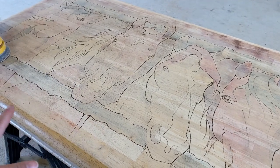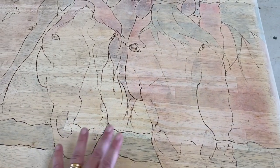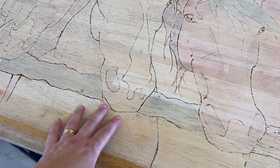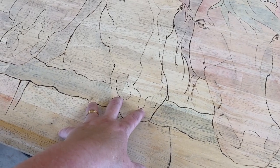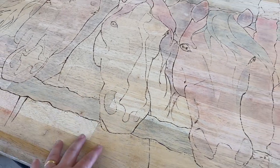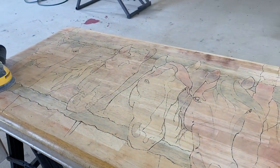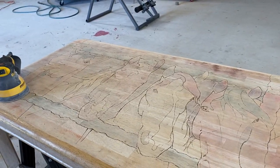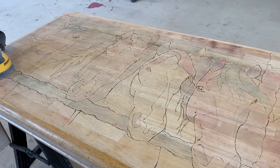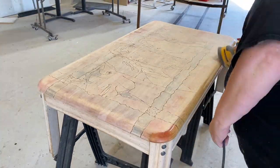The first thing I've got to do is prep it up. I'm going to start sanding this down because it was done with wood burning, so there's a little bit of an etched area in there. I need to remove the stain because it could have some oily residue along with all the finger dirt and stuff. We're going to start with a tougher grit — like 80, 100, 120 — and build up probably to a 240 grit on the sanding to prep it for the resin. Then we'll do some painting, and Rhonda and I are going to wing it on the color. It's going to be interesting, but it'll turn out dynamite between the two of us.